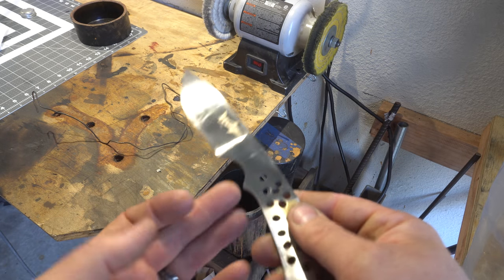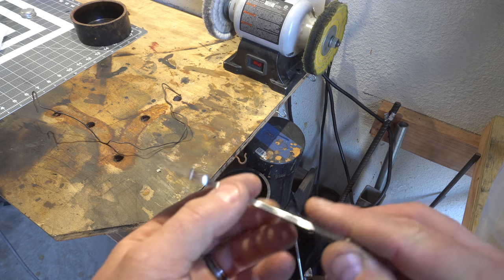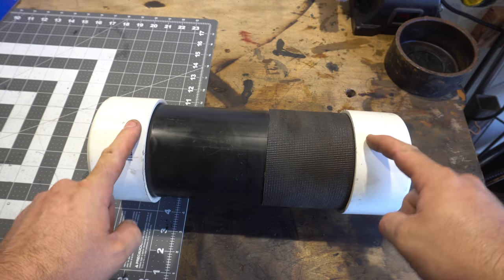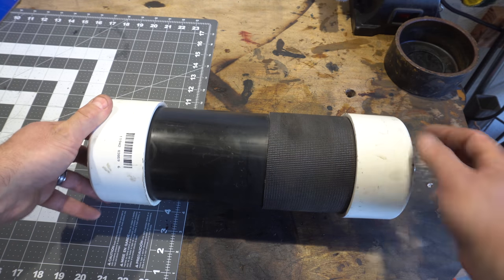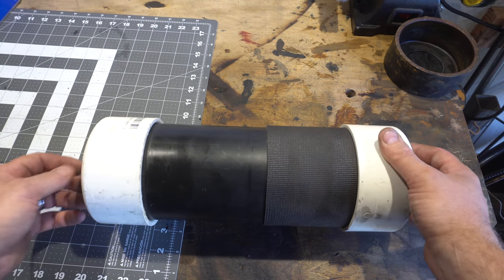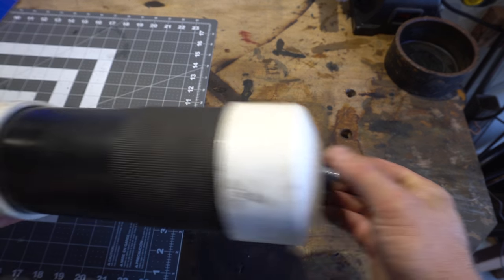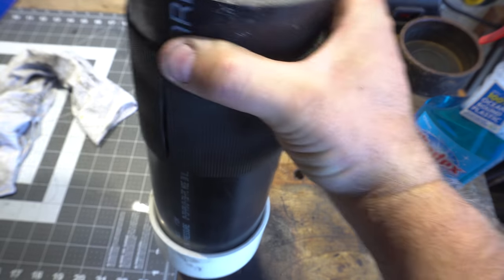I have the knife all sanded and we are ready to start our stone wash. The first step is to put it in the acid, then we're going to tumble it with some stones. So let's put it in the acid for a bath. While the knife is in the acid I'll explain the tumbler. This is just a piece of PVC with some caps on it. I used to roll this using my 2x72 with a little sled, which worked okay, but then you can't use your grinder and this takes a little while. So what I ended up doing is screwing bolts with nuts on either side so I could put it in the lathe. Here it is out of the acid — it's covered in Windex right now — but now it's going in. Let's put it in the lathe.